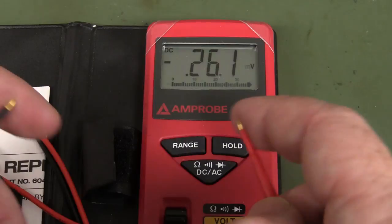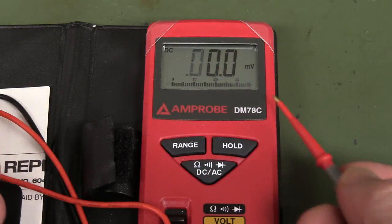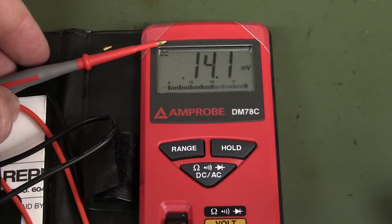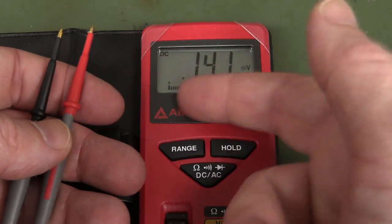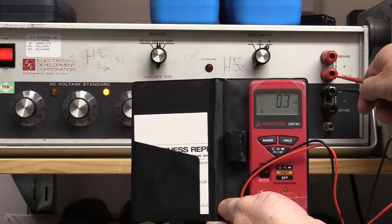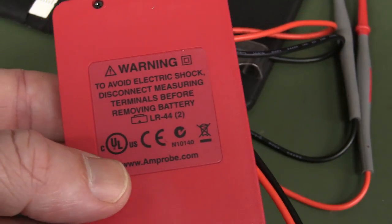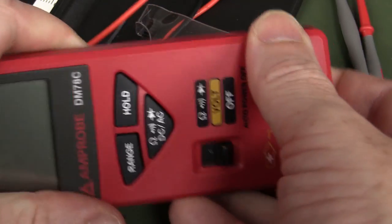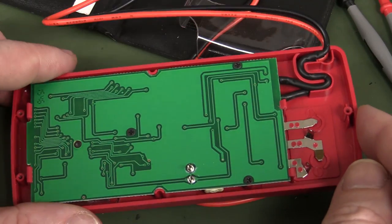The bar graph is going absolutely crazy — it seems to be picking up the capacitance of my hand. It must have a high input impedance and it's just picking up garbage. I want to call the white van for this thing! It does work — no worries — but hmm. Being Amprobe slash Fluke, this one is UL listed as well. Inside: nicely designed battery compartment for LR44s. Good strain relief. A decently engineered range switch. PTC hidden under there, high voltage axial resistor, and two spark gaps.